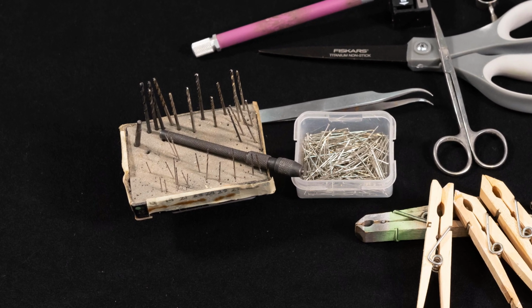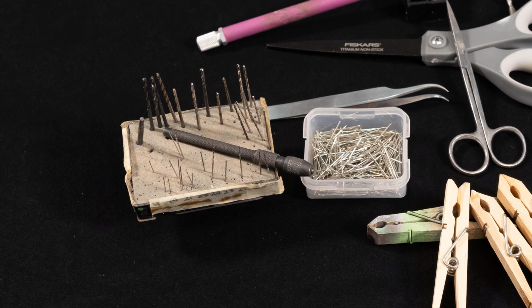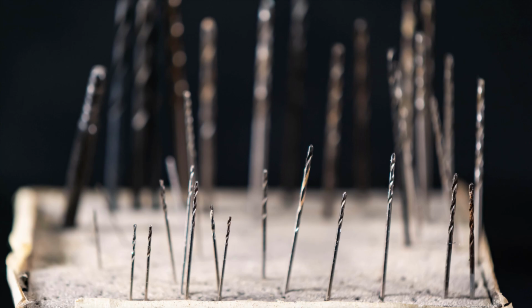That number 80 drill, just to give you a reference, is about 13 thousandths or roughly a 64th of an inch. You won't need anything that small, and in truth, you'll probably only need about 3 or 4 sizes for the whole project. So you may be tempted to buy the assortments, but they're a little pricey, and you really won't need many of those drills.